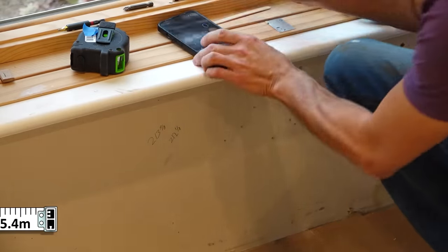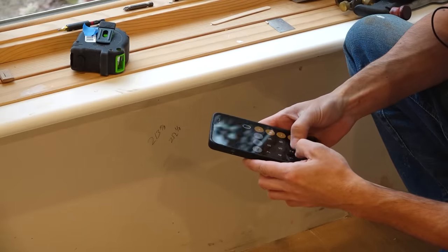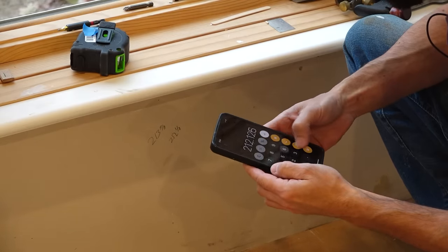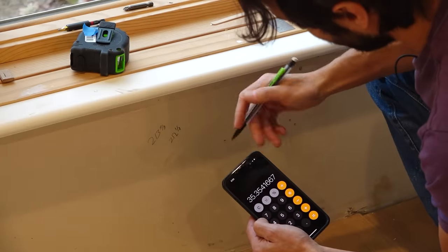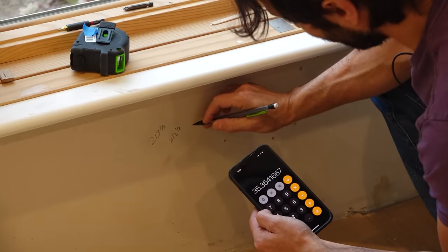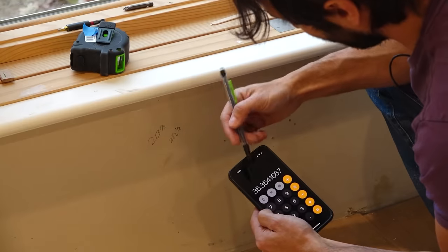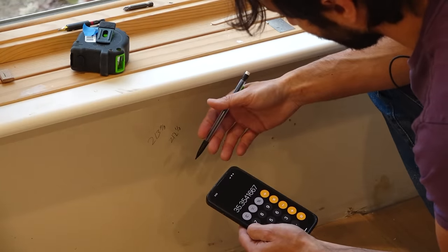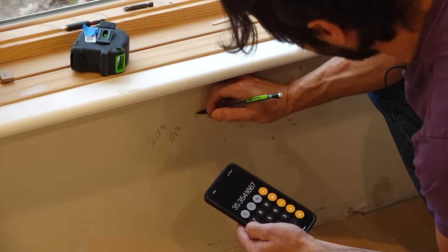And I want to divide that out into, let's see if we can get it to 6-inch increments. So we'll start with that number divided by 6. That'll give us 35 1/3 pieces, which is not an even division. So we'll have to mess around with the number a little bit to get it to fit. We can go higher or we can go lower. We can go to 36 of them or 35 of them. We'll go to 35, obviously. Let's go to 35 pieces.